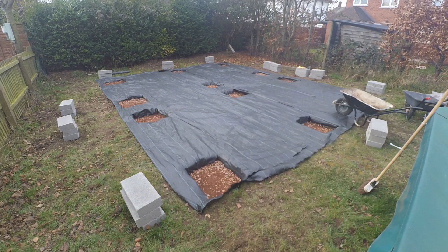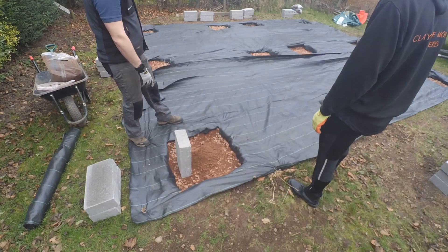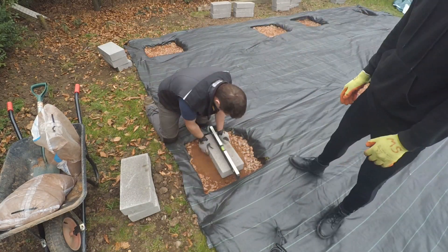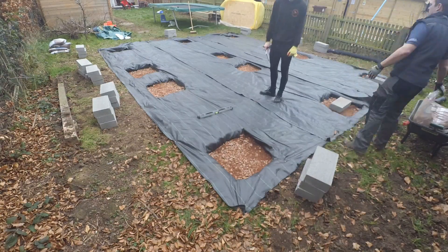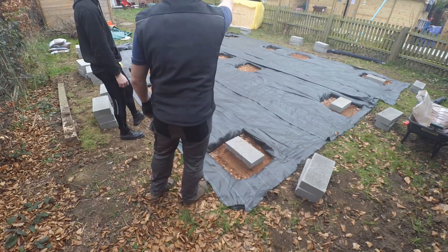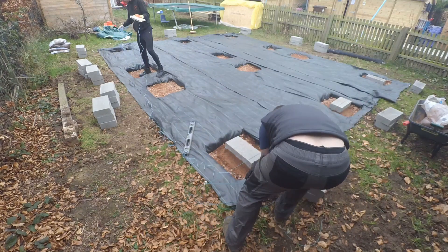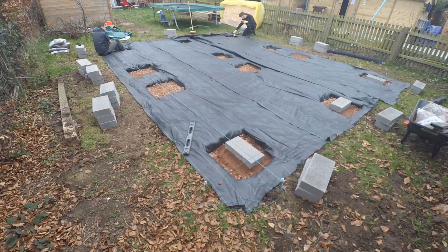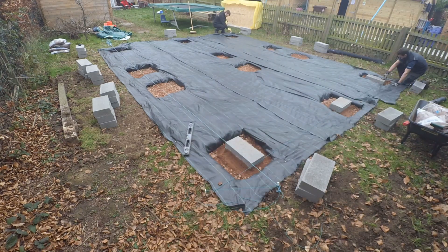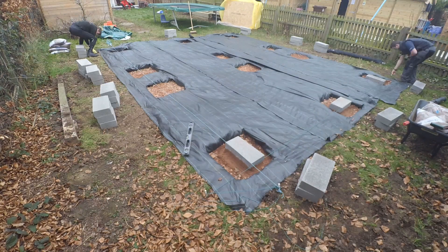Once this was done we had a go at laying out the first of the blocks at the bottom end where the holes were totally filled. I just used some sand to get a smooth base and then put each block in place and levelled it off. At that point I realised I didn't know exactly where the blocks needed to be and I should have marked out the outside shape of the workshop first. So we stopped, got the pegs and string, and used a digital distance measure to check the width, length and diagonals. After a little tweaking we got it within three millimeters square across a 7.8 meter diagonal, which I'm happy with.